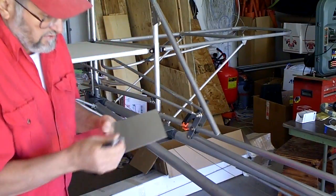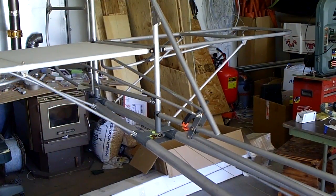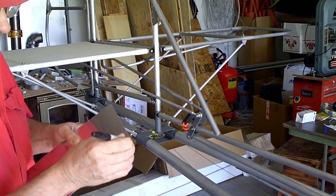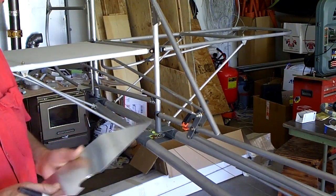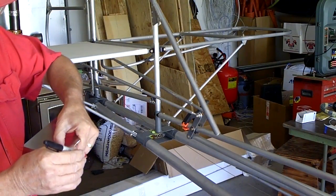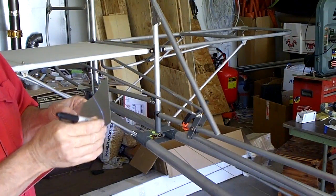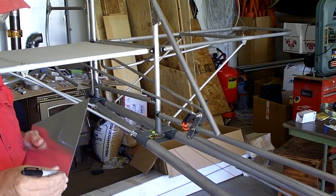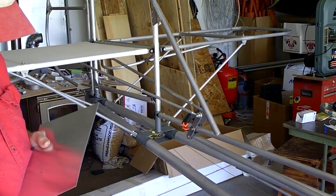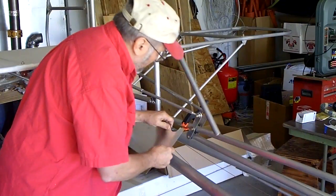On this piece I'll do the same thing. I'll take my marker and mark an edge distance. I've got to prime the pump on this pen. Just go in a quarter of an inch and mark my rivet line distance all the way around. And there we go. Now I'll be able to put this on the fuselage.